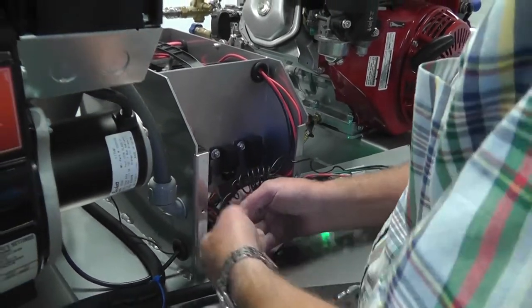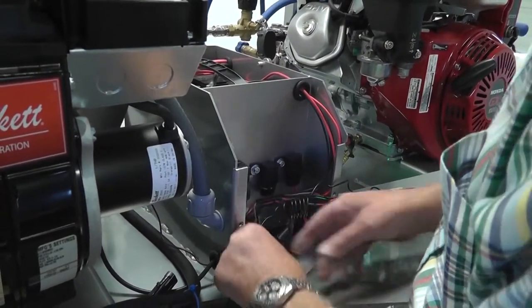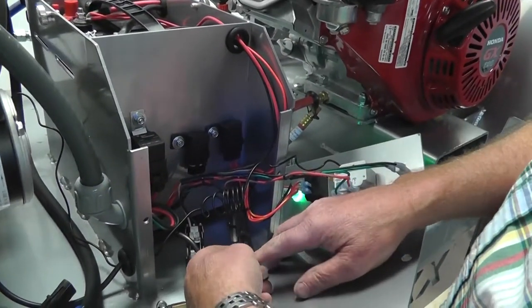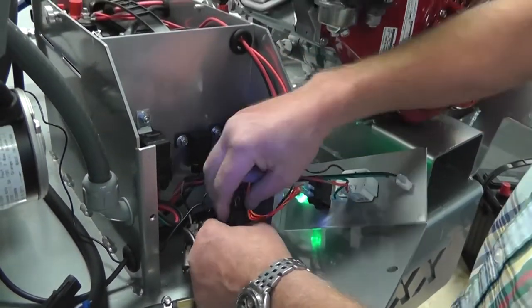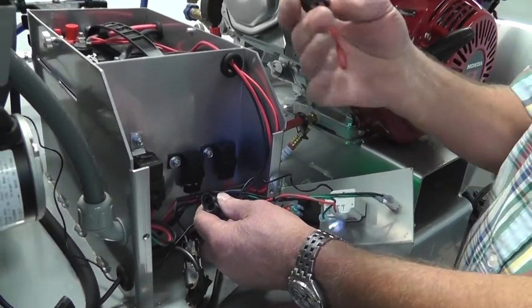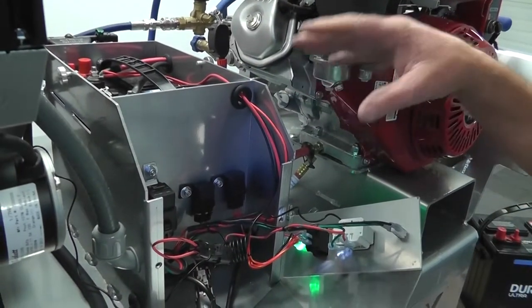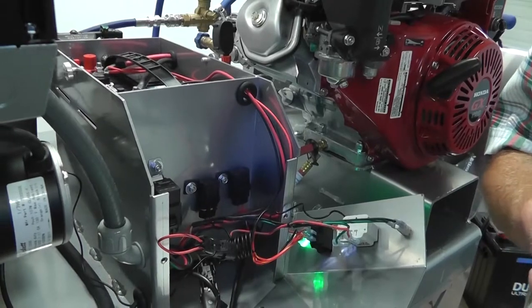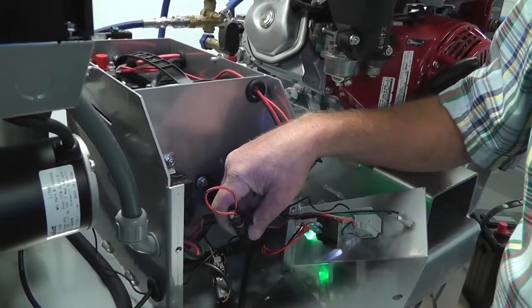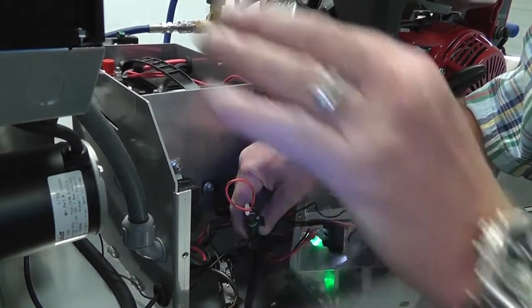If that did not fix it, put this back together. On the other side, the red and black wire — the red wire goes to the pressure switch. That is a different fitting, so you have to switch your tester. Plug that separate tester in. Now if it starts up, we know we have a bad pressure switch. You could put both bypasses in, but you do not want to run them this way because now you have no safety features whatsoever. But I would start by putting these in and seeing if the burner will kick in.